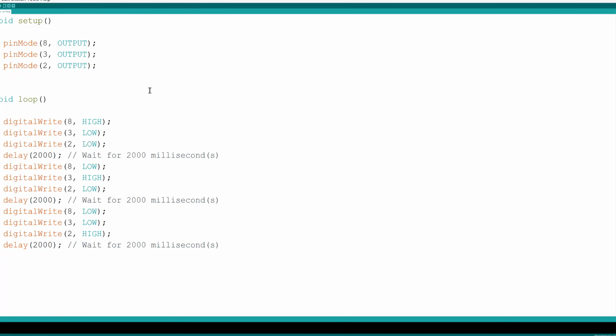So make sure you're on that, and then to compile it, you're going to go to Sketch. You first want to click Verify and Compile. What that's going to do is run and compile the code without putting it on your Arduino, so you'll be able to know if there are any errors in it. If there is an error in it, but it worked over in the program, then chances are you didn't copy it correctly. So just go back, copy it correctly, and it'll probably work out. If it does compile correctly, it will ask you to save, also heads up on that, so save it somewhere. It'll be saved as a sketch, and we'll talk about that later.